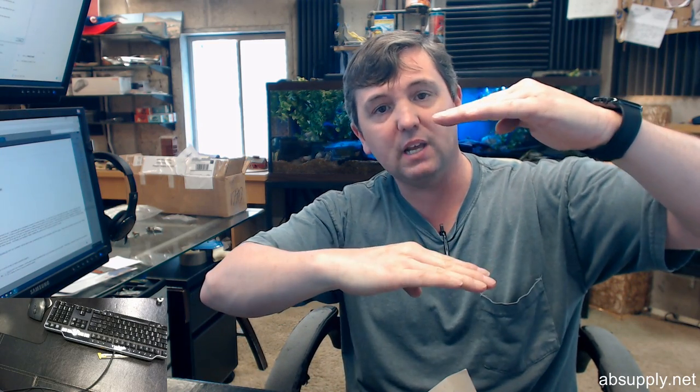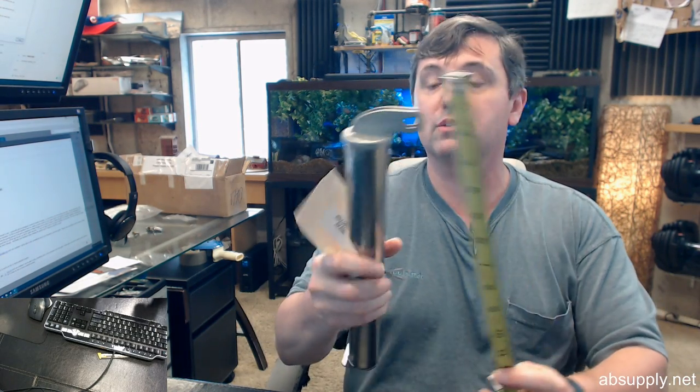Now, I've had people that have built custom hatches, like in a very tall, practically a two-story garage, where they've literally required it to open so far up, and the mounting point, top and bottom of the shock, was a fixed amount, you know, an A and a B amount. But when they got that opening up further to where they wanted it to be, like maybe 95 degrees, the tubes exited each other, and it became inelegant. I mean, sure, you could connect them together and then pull the whole thing down, and it was fine. But homemade roof hatches or unknown roof hatches have no promise or guarantee that this is going to work. Okay, I beat that dead horse.